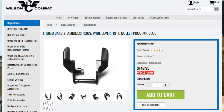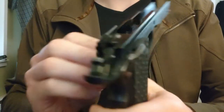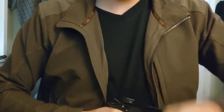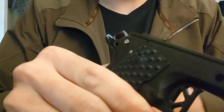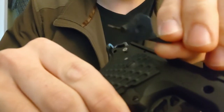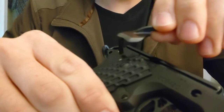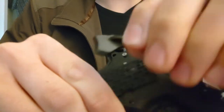You'll see that these safeties look like mirrors of each other, almost. The right-side safety is held in place by a special hammer pin. There is a dovetail cut into the safety itself that rides right inside where this jutting screw is, and that's what keeps it from being over-torqued.